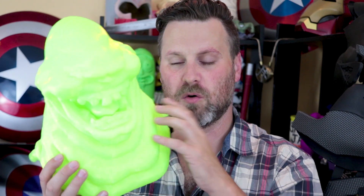I'm not even going to bother sanding or doing any post-process finishing on this — I just removed the supports. I printed this at 0.3mm layer height; I normally print at 0.2mm. I was looking to reduce the overall amount of filament and print time, and I think it just came out just fine. If it was a replica prop that I was going to be painting and sanding, maybe I would have chosen a lower layer height setting, but for this beautiful green PLA that I'm just going to hang on the wall, it came out perfect. As someone who grew up as a kid in the 80s watching Ghostbusters, this was an absolute blast to print.